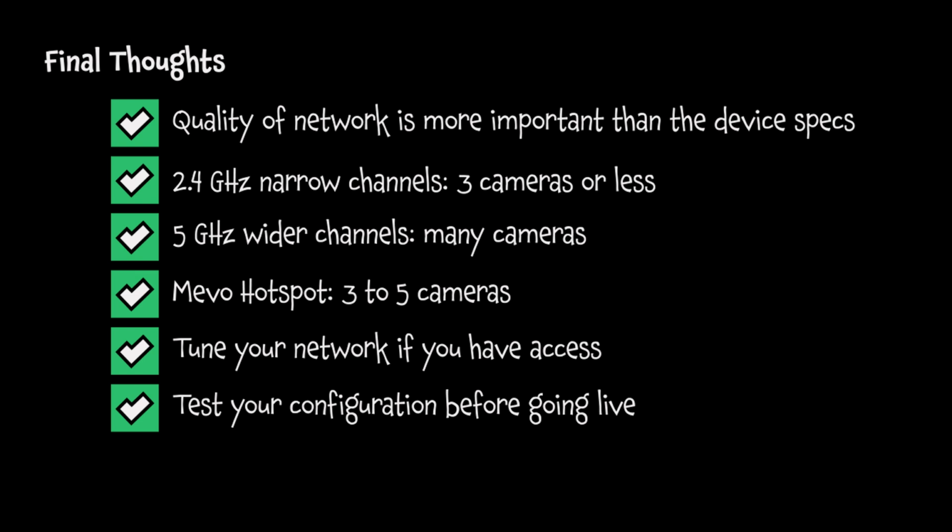The performance of your system tested at home is going to be quite different than when you go out and do a live stream in a public area. There can be many more people and Wi-Fi devices and access points in a public area that's going to cause interference. And a disclaimer, of course, do your own research. There's always going to be some factors that can affect the performance of a Wi-Fi network. In your particular environment, you might find that a 2.4 gigahertz network works wonderful.